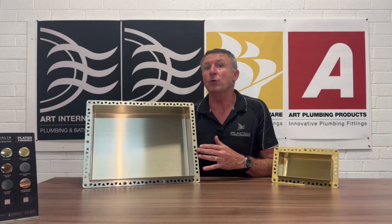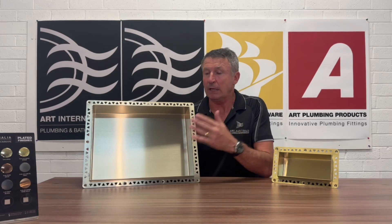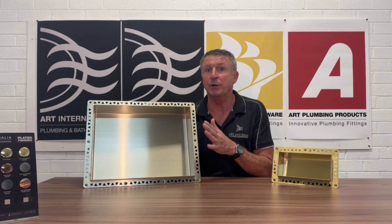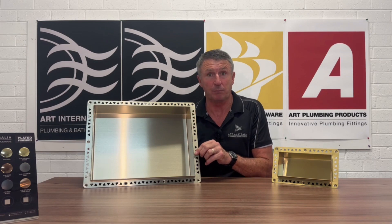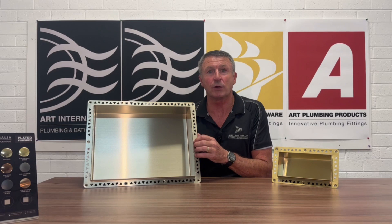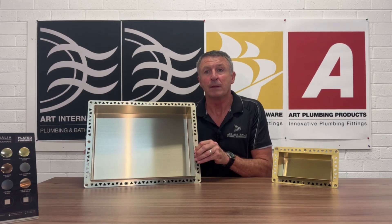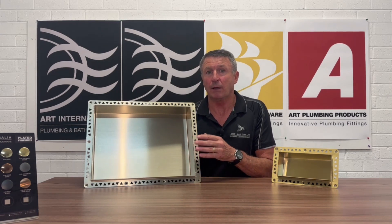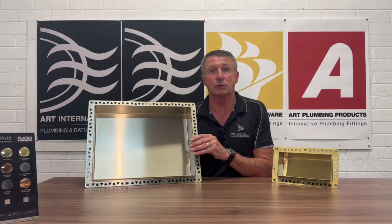However, let's just look a little bit more closely at that. From a waterproofing point of view, we haven't got multiple steps in this process. It is a sealed vessel. It's 304 stainless steel, all welded, can't leak. With the perforated flange, for waterproofing security, that ensures you'll get a perfect bond with your waterproofing onto the Anook. So all in all, this is a really good sleep at night product when it comes to waterproofing.